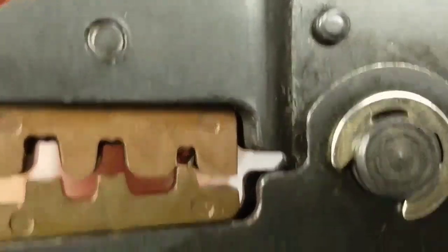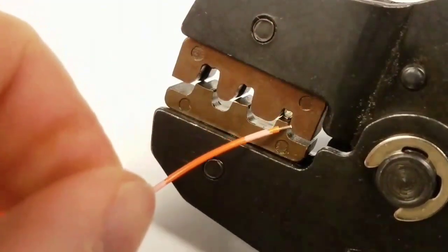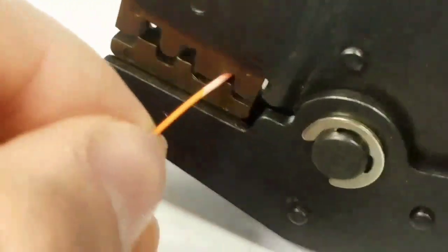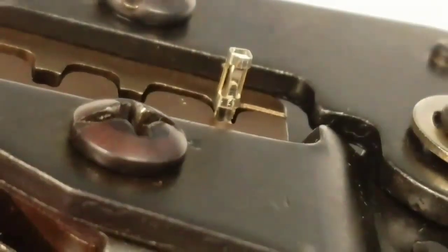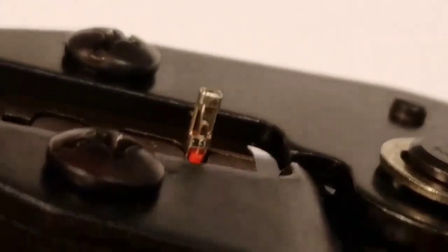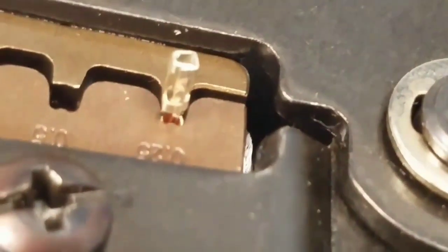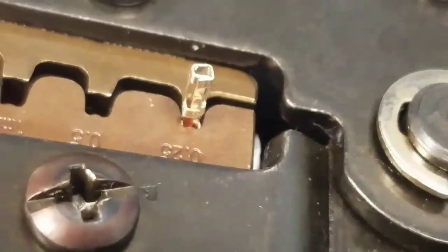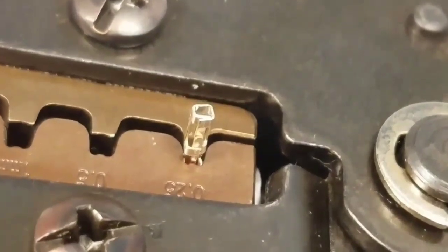I'm going to squeeze it just a little bit to get it started rounding, not completely. Now I can go ahead and feed my wire in from the opposite side. We leave this side hanging out so we can actually see where the wire ends. Right at the end of your crimper tool is where the end of your copper should fall — right at the lip. Clamp — boom, crimped.